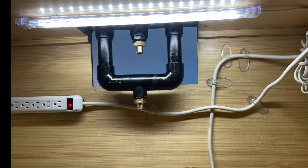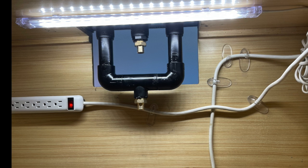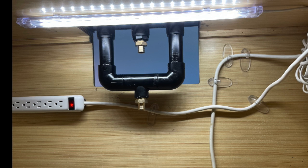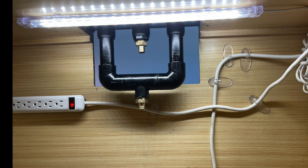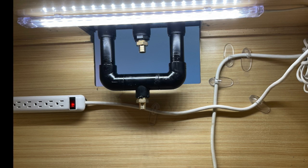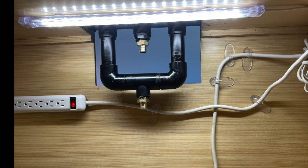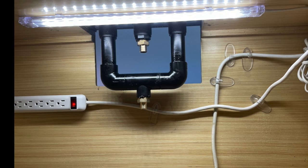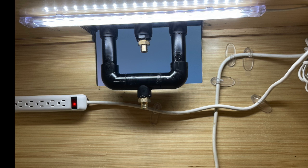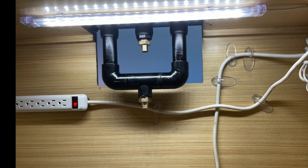Now you'll see it will go further, but once it kind of stops, stop. Don't try to tighten it up anymore because it is tapered. You think, well, maybe I should seat it all the way up in the plastic. Don't do that. You may be okay, but down the road, could take a week or two, the PVC will actually crack on you and you'll wind up with a leak. I've done that before, and I know that's what happens.